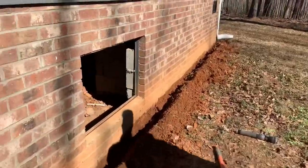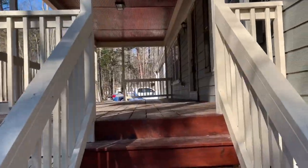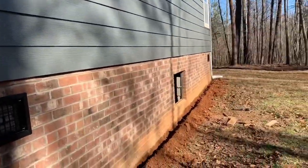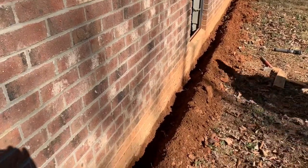On this particular place, that should be all we're doing on the outside. There's no concrete porches, just wood porches, so we don't have to drill that — it's pretty much just a trench and treat on the outside. We'll have to do some drilling on the inside where we found the termites, but this is the first part of it.